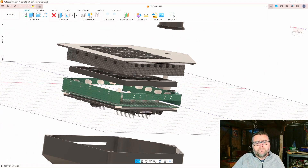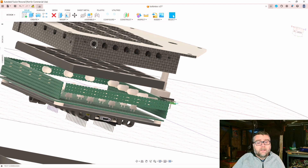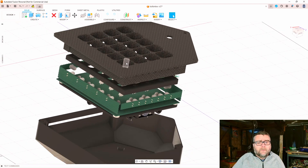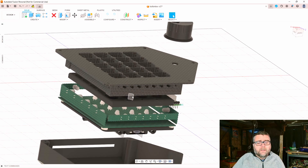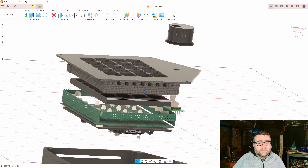Normally I release all my projects with 3D files on Printables, but for this project it's a bit clunky because I'm using 5mm LEDs. There are actually 3mm IR LEDs available, so I'm getting some in and going to redesign the whole thing and probably release that to you guys. Rather than having everything on it, I'm just going to have the button box with a header you can plug your own device into and program as you like — just the unit with the multiplexer pins and the encoder, and you can plug in your Arduino or whatever you want.